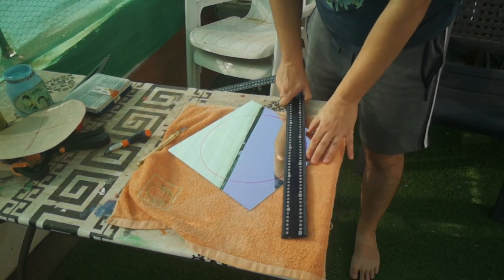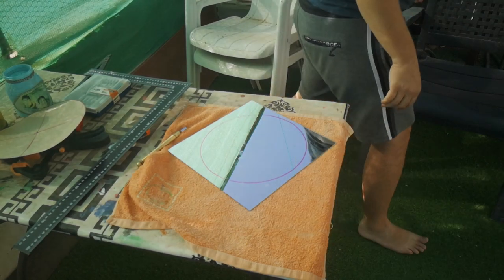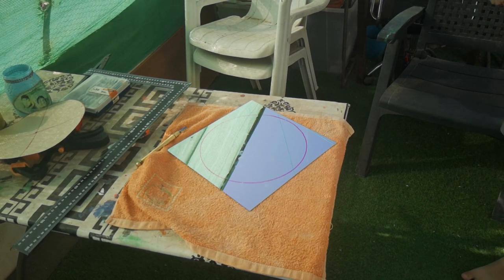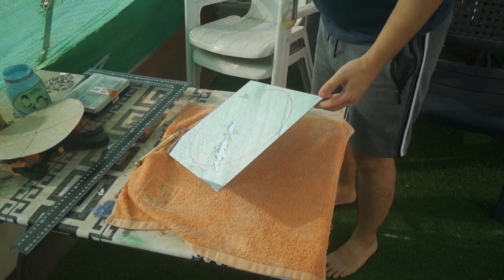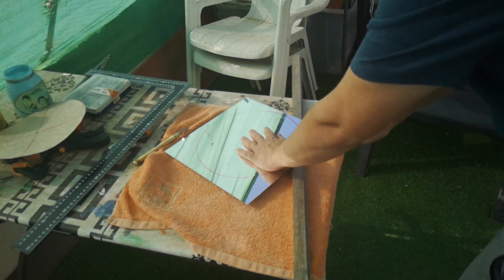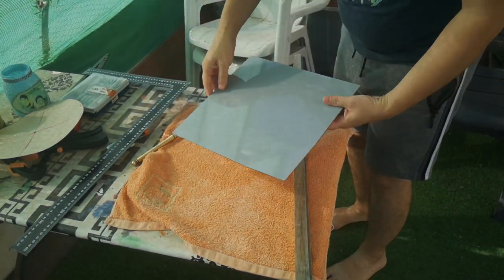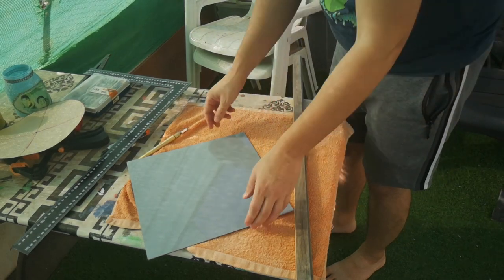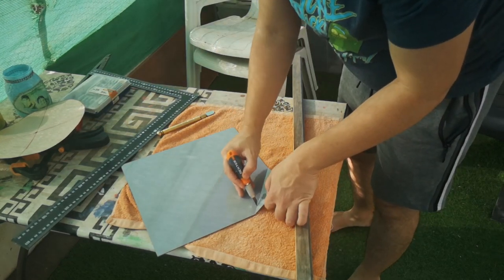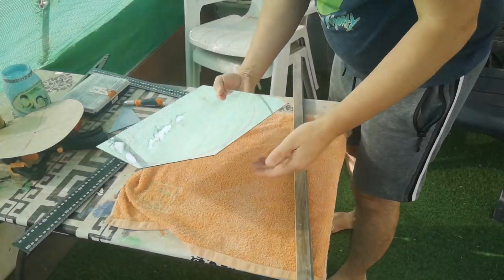One long score and you should be done. I take off the ruler. Another tip I saw on the internet was to put a dowel under the actual score line to help focus the force into the crack. I have a piece of wood from my last video. I just pushed down with two fingers on the corner and it cracked really cleanly. The piece is really nice - I'm not too unhappy with that.